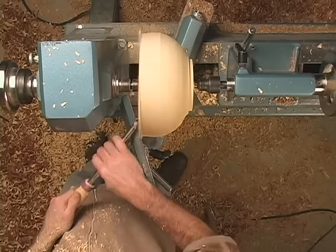And once I have that cutting surface hot and red, I drop it down to meet another surface so I don't turn it blue. There we go, now I'm on the cutting edge. And I drop the handle to meet a new surface and roll it to the nose. Now that's a nice fresh cutting edge.